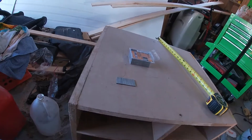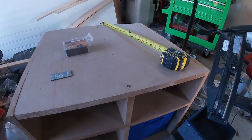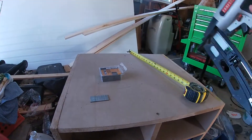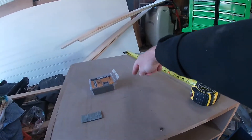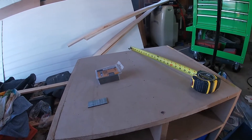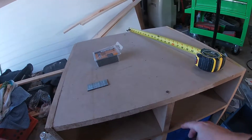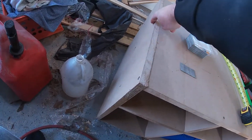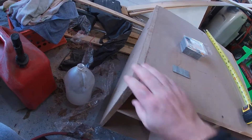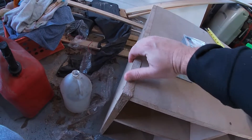These screws ended up not doing so hot — some of them bit, but some of them didn't, and I wasn't too happy with it. So what I'm going to do is use the finish nailer and litter all around the seams — that way it should stiffen this up. There's a little bit of movement here. I did shoot into here and up into here, and that way it locked these in, which worked fairly well. I'm going to go ahead and litter these out with nails, then take out the stripped screws, countersink them, and put them back in. I'll leave the screws that did catch in there because they provide more strength than the finish nail does.